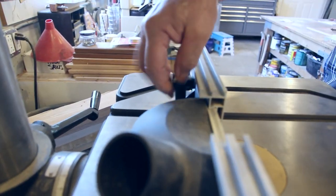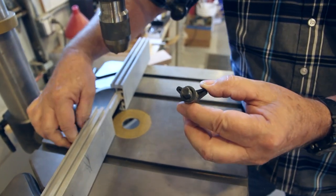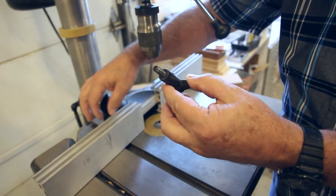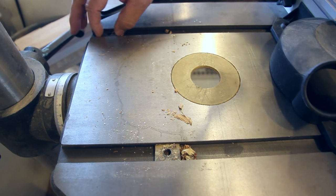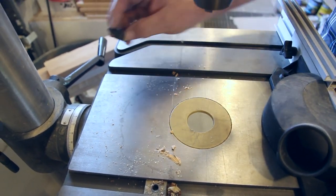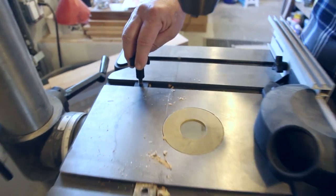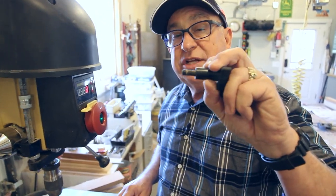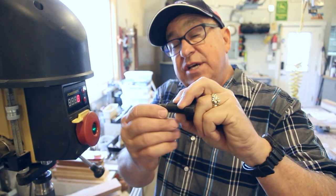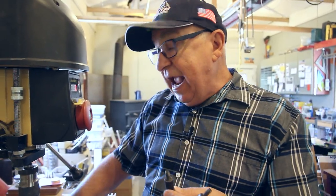First, we're going to remove one of these bolts right here. As you can see, that's what it looks like when you remove it, and I'll remove the other one as well so you can see what it's fastening into. What you've got are threaded inserts that slide under these keyed miter areas — they fit into T-shaped slots so you can't lift them out, and these bolt through them to tighten. Now these may look like 5/16ths standard threaded bolts, but they are not. They're metric — 8 millimeter, 1.25 thread pitch. So you need to get those from a good supplier. Let's go ahead and build an adaptation to extend this and get the handle up above it.